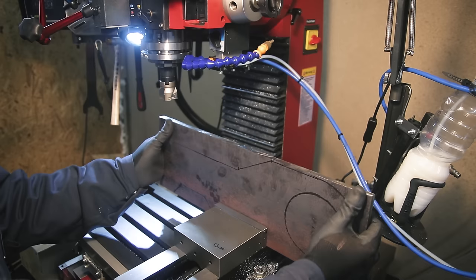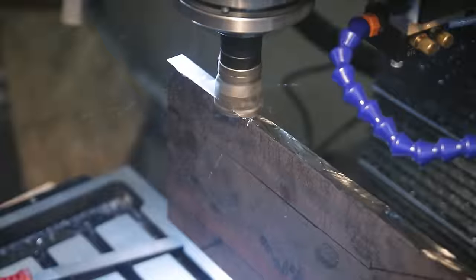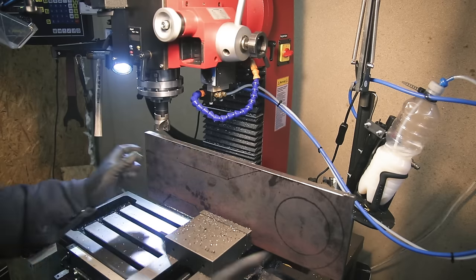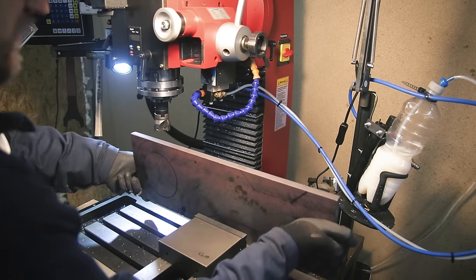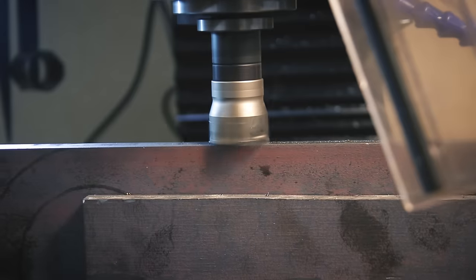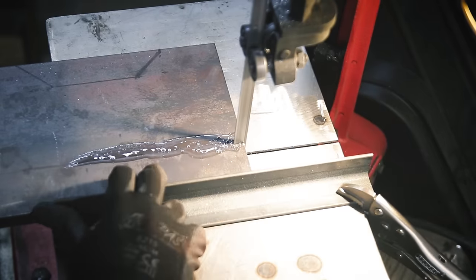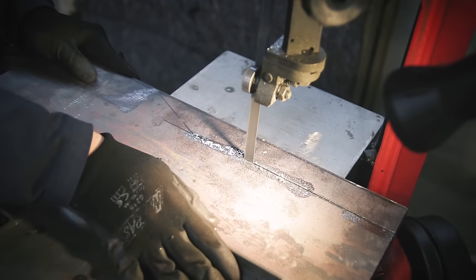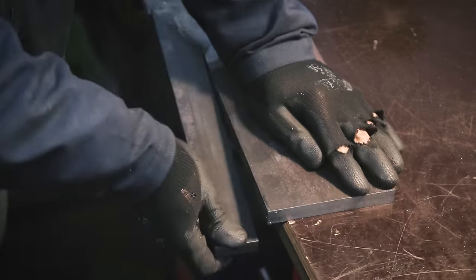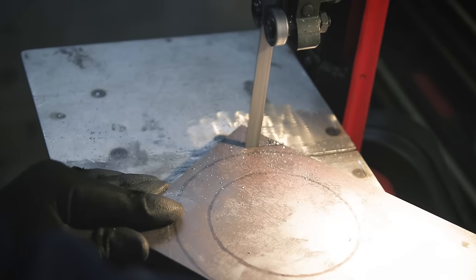Now I can take this over to the mill and face that rough edge I just cut, to create my first clean reference surface. I drew on the rough shape with a marker just so I can see what's what and keep myself from making any dumb mistakes. Now that I have one side that is flat and straight, I can flip the part over and face the opposite edge, giving me two edges that are straight and parallel. This piece is now small enough to fit into the bandsaw, which helps cutting out this chunk on top. Right now I'm just roughing out the outside shape, but all of these edges are going to be machined eventually.